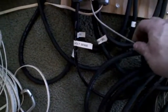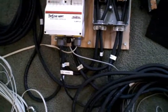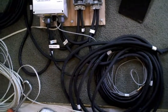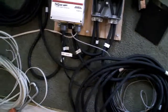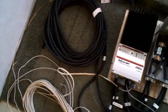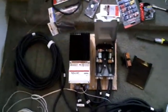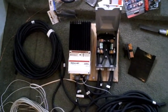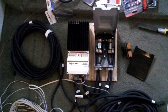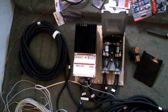I've got my two wires for the volt sensor and a temperature sensor wire — this unit comes with a temperature sensor. The correct charging voltage for the batteries varies with battery bank temperature, and since the controller is inside a heated area and the batteries aren't, I need a temperature sensor that mounts to one of the battery lugs. I've got my photovoltaic cables, battery cables, and temp sensor that go to the battery. There's also an optional accessory for the TriStar: a remote display that shows what the meter is doing, lets you manually start an equalization charge, and shows how many amp-hours have gone to the battery. It would be nice to have that somewhere handy.